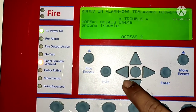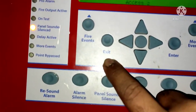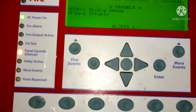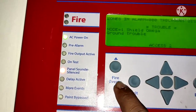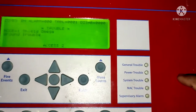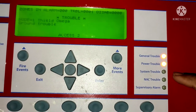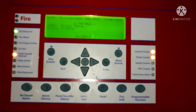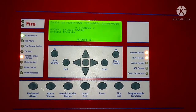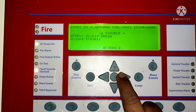For example, at the right-hand side, there is no battery connected to this panel, so there is a power fault — a power fault indication will come. Right now, AC is connected with this panel, so there is an indication that AC is on. If there is any general trouble, the general trouble indication light will be on. Since the battery is not connected, there is a power trouble. In the same way, lots of trouble indicators may come on.